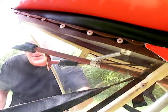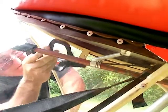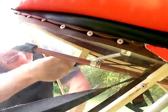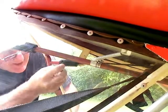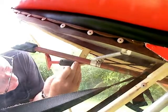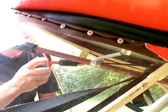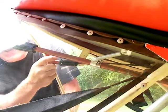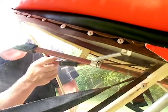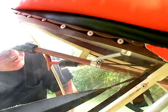As far as the ballistic chute goes, this is the handle for the chute. You don't want to get it mixed up with the one you pull to start the engine. This has a pin in here — supposed to have a remove-before-flight tag on it, looks like a pin to a grenade. But I leave it in because if I ever wanted to use that chute, I figure I can pull that pin out real easy. I don't want somebody to pull this thing by accident — I've seen little kids go and pull them and shoot them off.